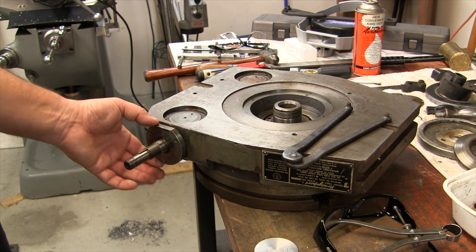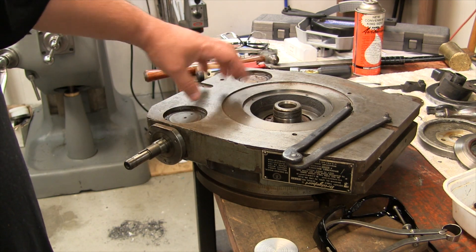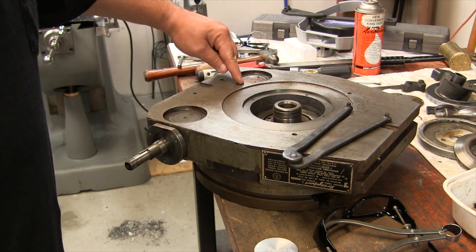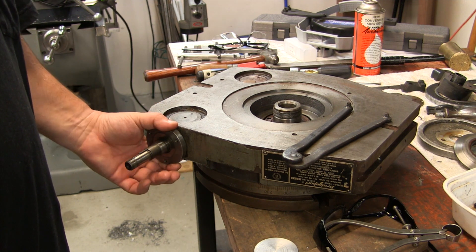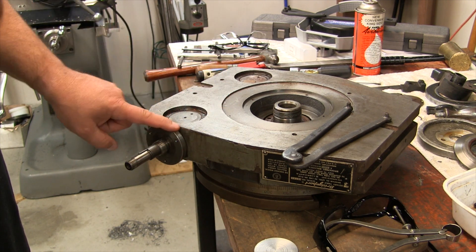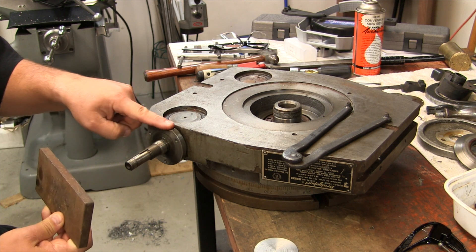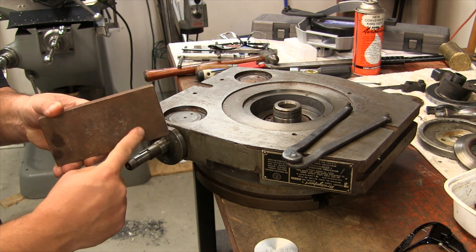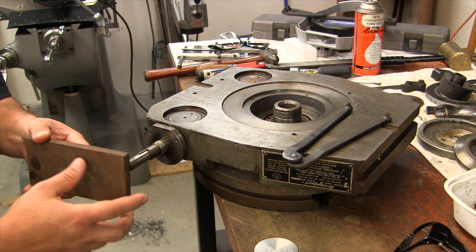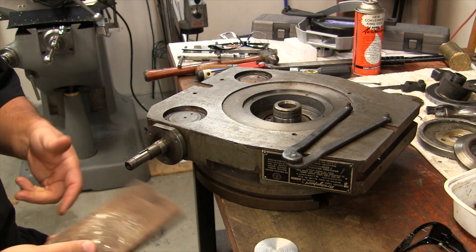I am not getting off this easy. I have to make a tool for this bushing. This bushing unscrews out of this section right here — this is a pivot, so this thing pivots. The shaft runs through here, it sits in here and pivots. So this bushing is screwed into this guy right in here. What I need to do is take a measurement around this diameter, because there is a flat here. I am basically going to trace the circle around here with the flat, bore this out on the mill, make a little clamp that sits across the top and bolt down — basically make a wrench for this. Then we'll put a long handle and be able to break it that way.